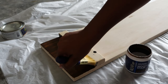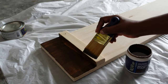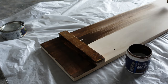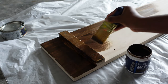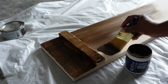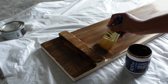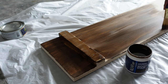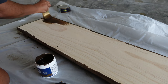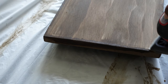I did one coat of stain. If you want to do multiple coats you can, but I liked the light wood underneath and just wanted that slight color, being that my bathroom had dark ebony woods — I wanted that light wood to peek through. I applied the stain to the back of the tray first, which I found you should actually apply it to the top first, because as you can see, it did bleed a little bit. But it brought character to the tray with that mistake.